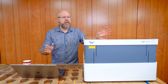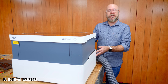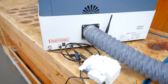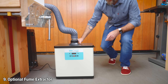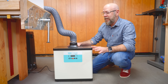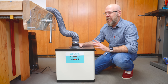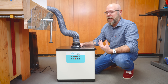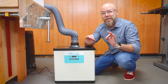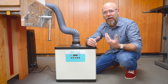This is definitely marketed as someone's first laser. Laser cutters create smoke and fumes, so there is an integrated exhaust fan built into the machine, so you could run this right out the window. Not all lasers have a fan built in. The fume extractor is an extra $600 and it works pretty well, but if you have the option to vent out the window, save yourself $600 — venting out the window is just a better option.